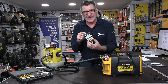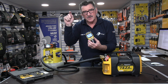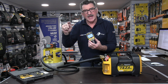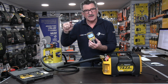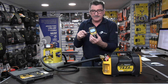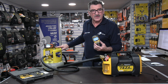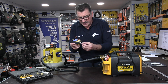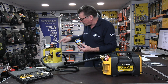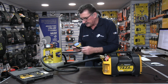It has two sensors in here. One runs from atmospheric down to 15,001 microns, and then another sensor runs from 15,000 down to about one or ten microns. So this thing goes really low. On standard vacuum gauges they only have one sensor. I like the fact that it's got this central outlet rather than the two-port setup on the Testo — I find that quite handy.